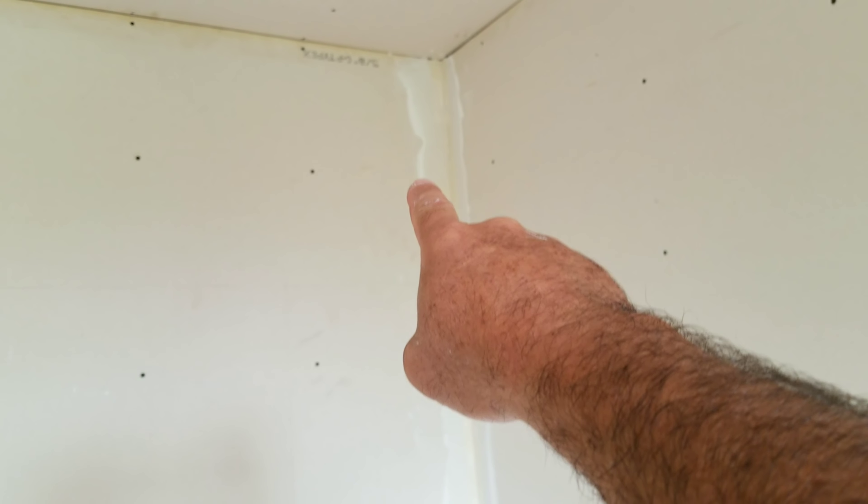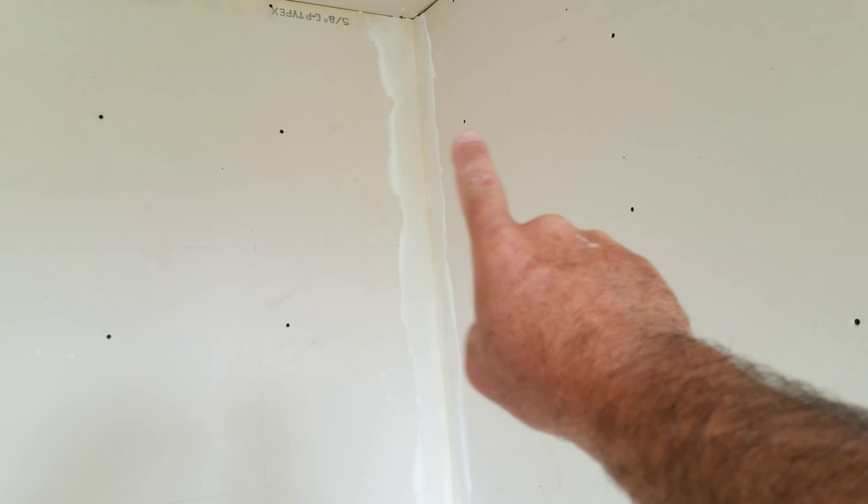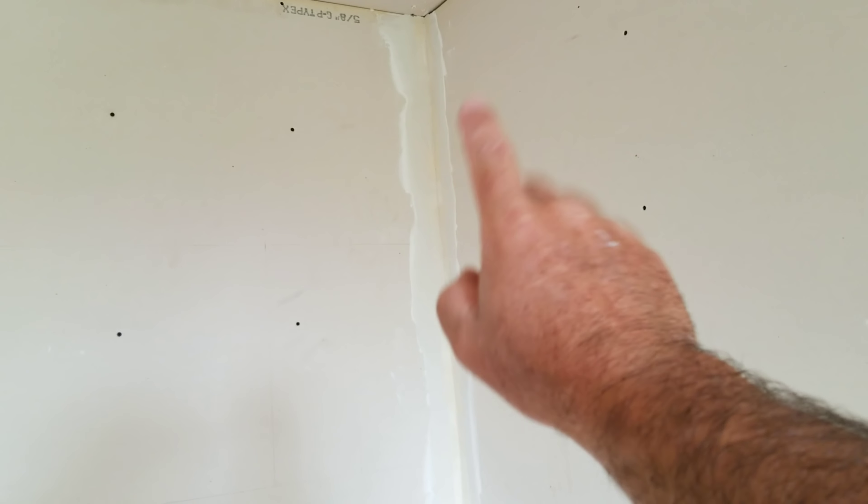You can already see the whiter areas — where it was a lot thinner on the edges — are already drying out. She's drying as it goes. Depending on the mud you're going to use, they have all kinds of stuff: some is 20-minute, 40-minute, 90-minute — that kind of stuff. So just be cautious of what you're buying, because if you have a big area to cover and you're not burning through all the material, it may set up on you quite quick. You might be in the groove thinking it won't take long, and the next thing you know you have a big hard lump in your bucket.